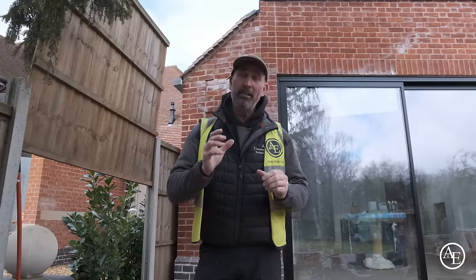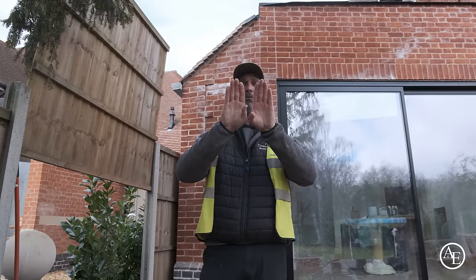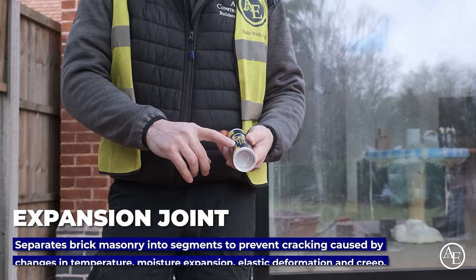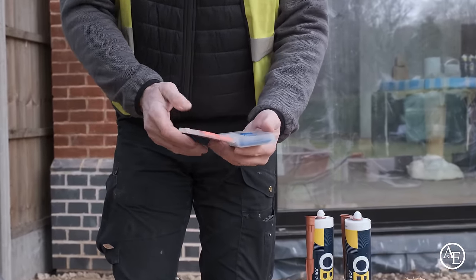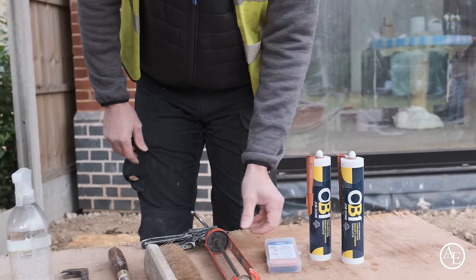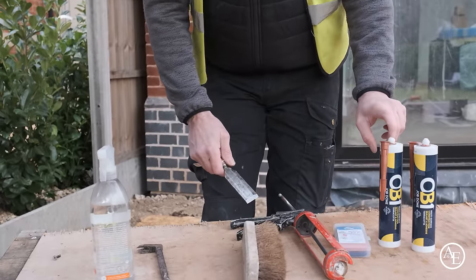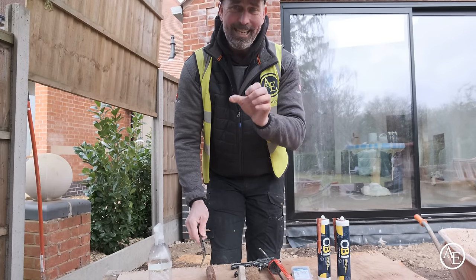So today the job is I've got to put some sealant down a brick joint. The one we're doing here is brick to brick on the corner reveal — sometimes you'll get block to block or brick to brick — and it's called an expansion joint. This expansion joint is 10mm. I'm going to be using an OB1 product, which is a multi-surface sealant as well as an adhesive. The colour we're using to match the bricks is called terracotta. We're going to be using a silicone jointing kit — this is a chrome make, really good, bought it from the tile shop. We're going to use this gauge, a skeleton gun to pump the mastic out, a brush to brush off debris, a chisel to set the gauge off the size of the mastic, and I use this — you can also use a bolster — just to push the foam out of the way to make sure you're getting enough mastic in there to really key in properly.